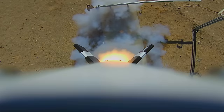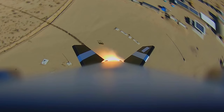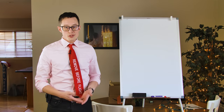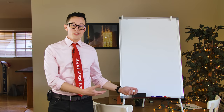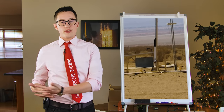This flight was just about roll control, not pitch or yaw. To control the roll, each of the four fins needs to move equally, and we can tell in the onboard footage that's not happening. At the beginning of the flight when everything's working, we see the fins match each other, but quickly after launch the fins stop matching because the mechanical joints on the fins begin to slip. If the force of the air on the rocket can destroy the joint between the fin and the servo that moves it, the question is: how did I not catch this before the flight?